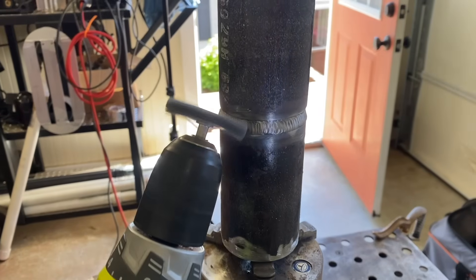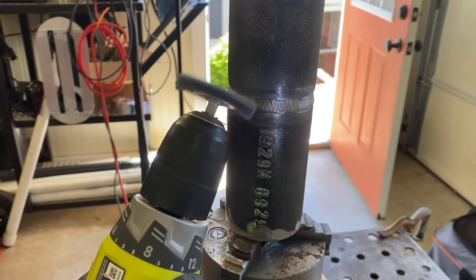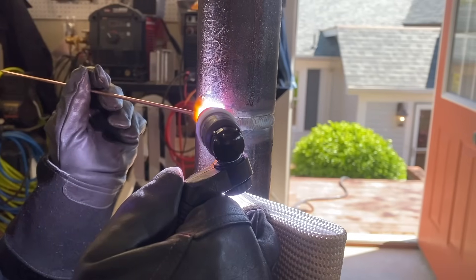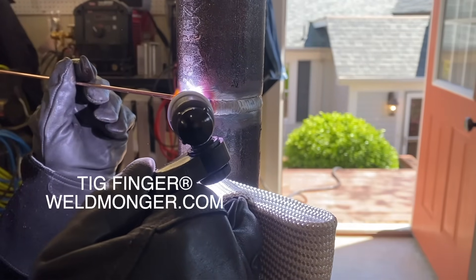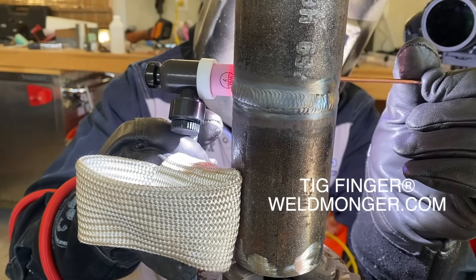I work hard to try to get good arc shots because I know it makes a video a lot more instructive. Let's do a quick wire wheeling before that very last bead. I like to use a drill motor with a wire wheel because it doesn't sling wire — with that slow RPM, you don't have to worry about slinging a piece of wire into your nose or your eyeball. Here comes the last bead on this two-bead cap. Andrew's rock steady — still using 1/8 ER-70S6, still at 100 amps, with the positioner going at a slow speed for capturing this arc shot. Andrew's trying to just overlap the top edge of that hot pass while coming down evenly over that previous bead.